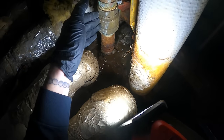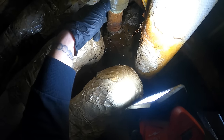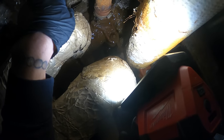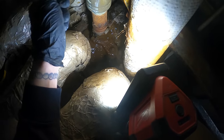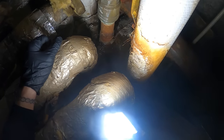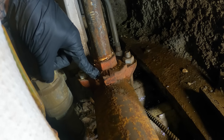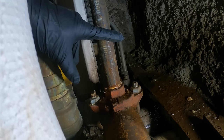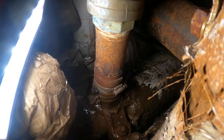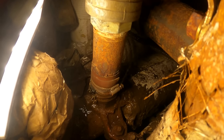We have copper, a brass valve, and then this nipple here is completely destroyed. I'm really hoping I can get that off and rebuild right from that thread. I hope I don't have to take off that victaulic tee — this is three inch pipe going up to an inch and a half. I'm thinking to rebuild it from there to about here. It's basically a similar setup: we have a main pipe, this one got a victaulic tee and then it tees off through here. The issue is it's leaking right at the thread where it goes into this victaulic tee. Let's let this thing drain out and hopefully we can do this.